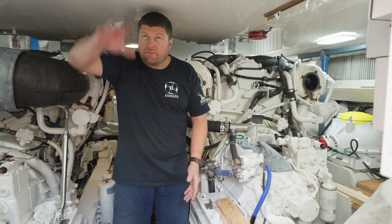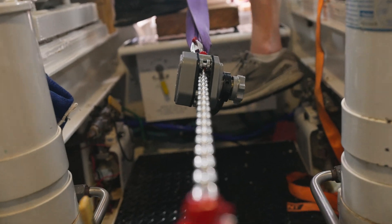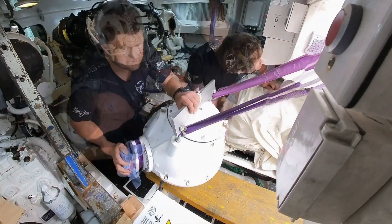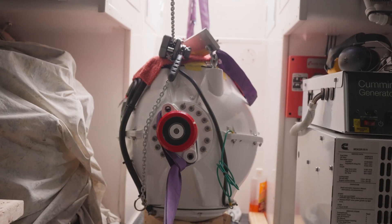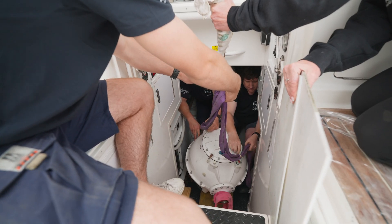You can't lift straight through the hardtop floor, so what we did was secure soft slings and a come-along chain block back around the engine mounts, then shimmy the gyro down on the LVL we had in position. The sphere is so heavy at 318 kilos that it's millimeter perfect — it's really important to have the right gear and the right people on the job.